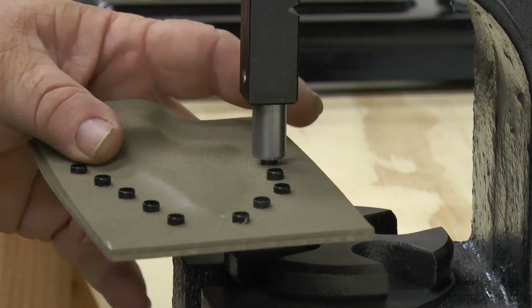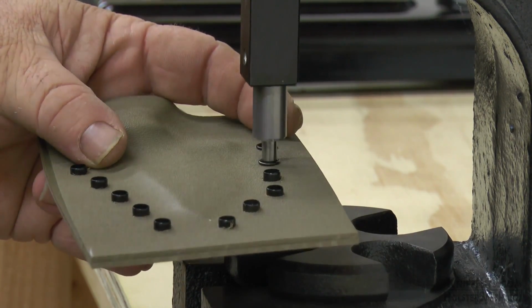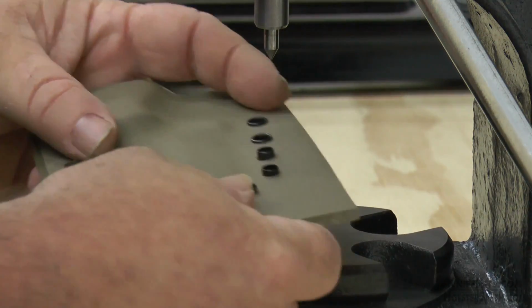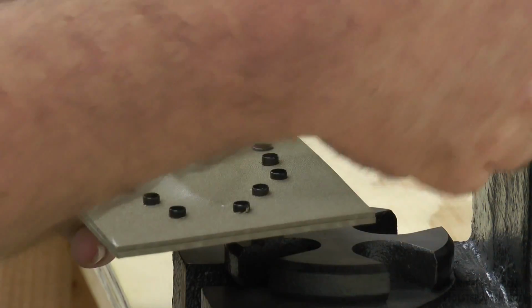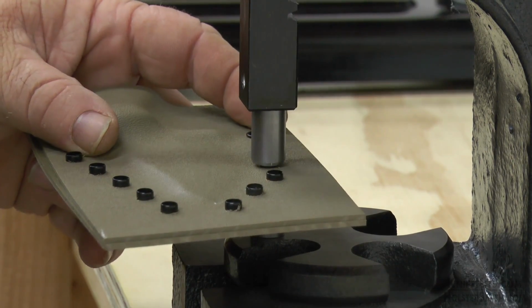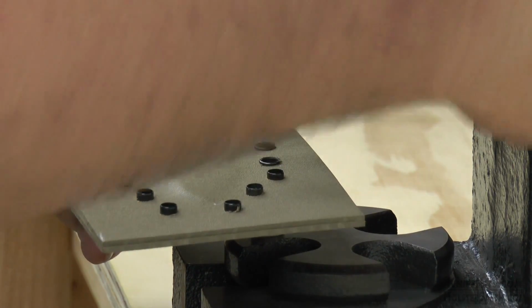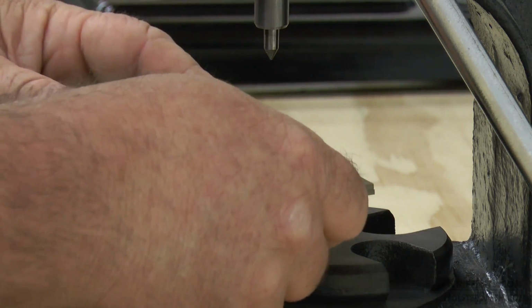Bring the spike top down. Move it around a little bit, make sure everybody's happy. And go ahead and roll the eyelet. Now some people call this rolling, some people call it flaring, some people call it squashing. But it's all the same thing. You're forcing this little brass tube into a cone, and it's rolling it around, hopefully in a controlled fashion.